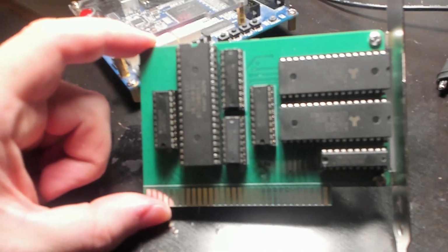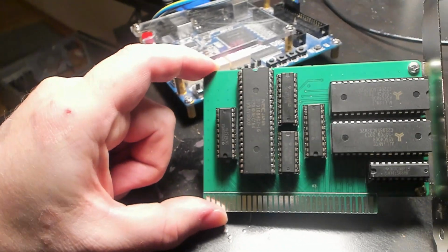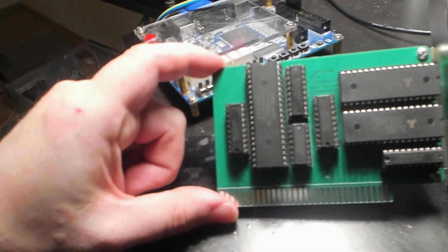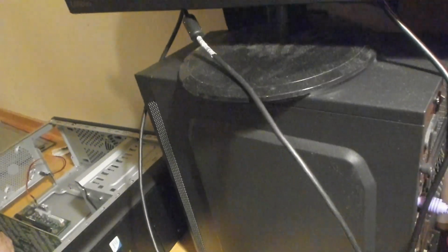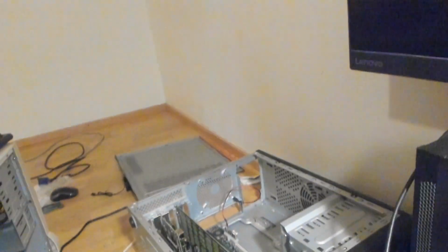So anyway, I kind of like this board. This basically just has the CPU and memory and a couple of bus transceivers and nothing else. This is actually more or less like a standalone thing that can boot. Now I do feed some signals like the oscillator and the clock signal from the FPGA, and the reset signal, and actually a bunch of other things I also feed from the FPGA, which acts as a mass storage device, or actually there's a Raspberry Pi connected to the FPGA, and that is the mass storage device.